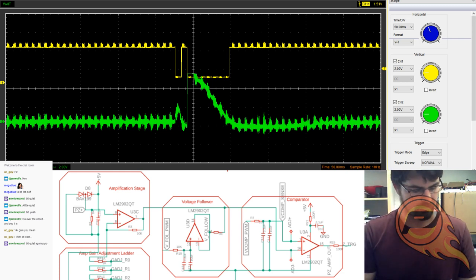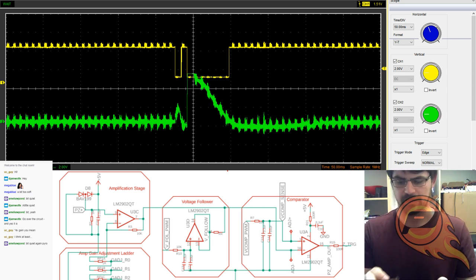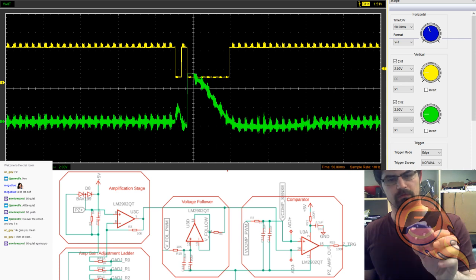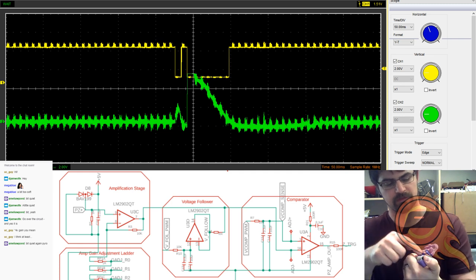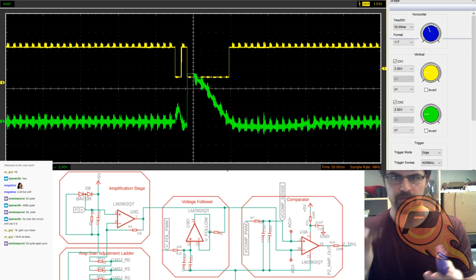Speaking of which, I got a couple of the mounts that I built here to showcase exactly how those work. Haven't gotten these actually installed in anything yet because I was silly in using the Drylin bearings when I shouldn't have been, and kept on binding. I thought there was something wrong when there wasn't. Anyway, so we've got our X-axis carrier, which has the bearings, and it's got our little channels for the belts and a set of mounting holes for the piezo board, and we get our fulcrum.